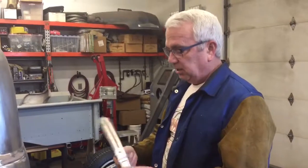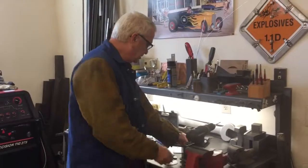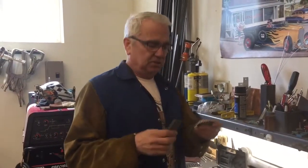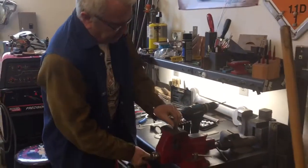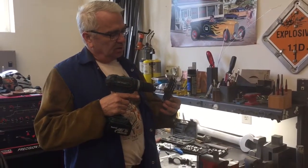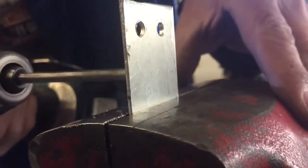I think it's about 12 bucks at Home Depot. Here's a cool tool — let me show you. I've got a piece of aluminum here. Let me take my gauge and find out what size it is — 16 gauge aluminum. I'm going to drill a 3/16 hole. I take my drill gauge, find it, and — look at that — it's 3/16. Now let's drill a hole in here.